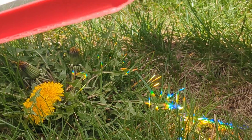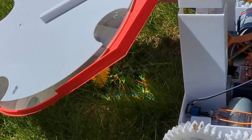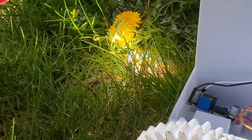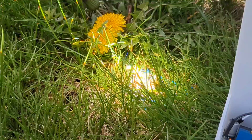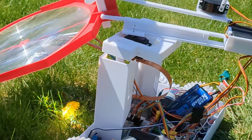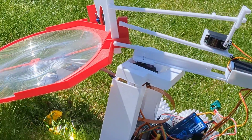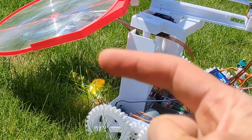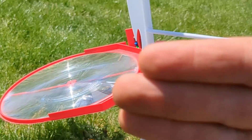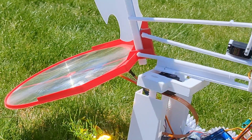It drives forward a little bit — what it's doing right now is actually looking at the ground directly under that light. It checks an arc under here; you can see it's nicely focused. Whatever the swing motor can cover as it's driving, it's going to try to kill in that area. Here it's just seen that dandelion and it's trying to run and kill it — you can see that dandelion is smoking. It's driving forward and back because it needs to cover a small square area, running the Z motors up and down to focus not just on the ground but slightly above it, and moving the swing motor slightly between each run to cover an entire patch. When it's finished it puts the lid back down.